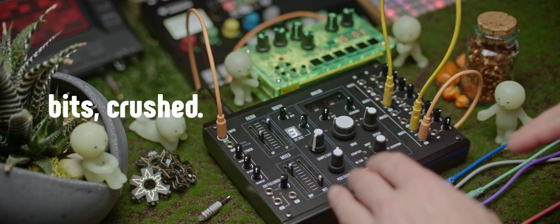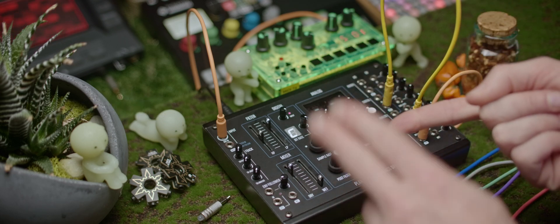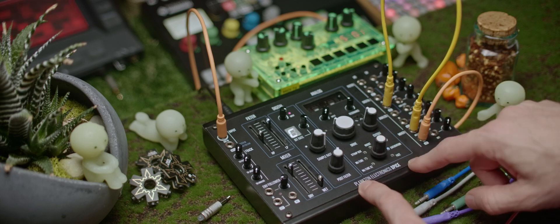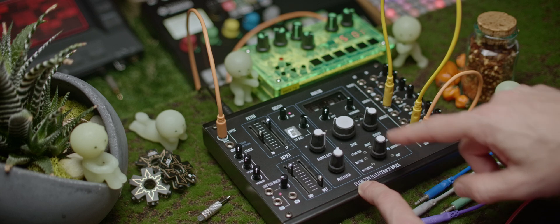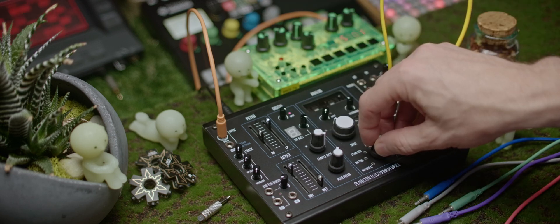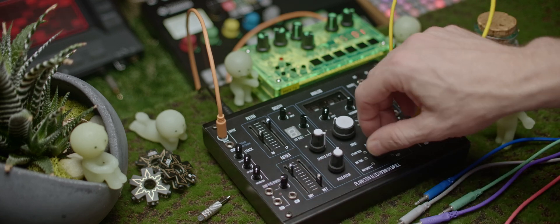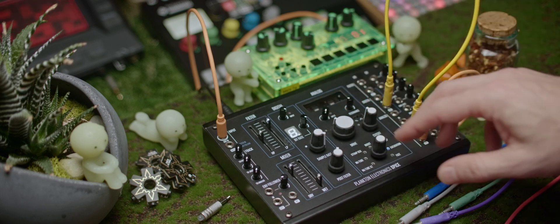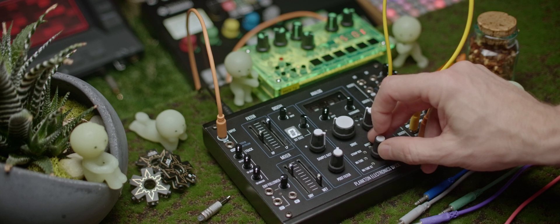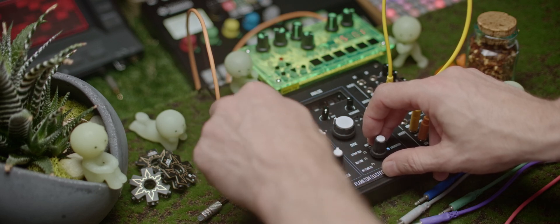That was the main digital mode — bit crushing. There are actually three more modes: bit muting, bit inverting, and bit swapping, accessible through the main encoder by double-clicking. The first mode is bit muting. Whenever there's a dot in the LED display, the bit is muted; when there isn't, it's letting through. Let's mute middle bits, around five and six. Interesting things happen with bit muting. Let's bring everything back to normal.